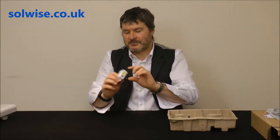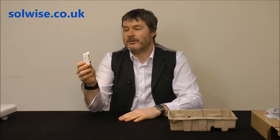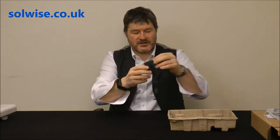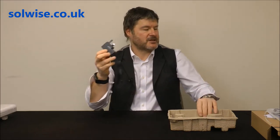We've got a little plastic POE injector. The device is POE powered using 12 volt POE, so don't use 24 volt or 48 volt or it'll pop. Use the proprietary 12 volt POE with this little injector that comes in the box. And to go with the injector there's a little plug-top 12 volt DC power supply which plugs into the injector.